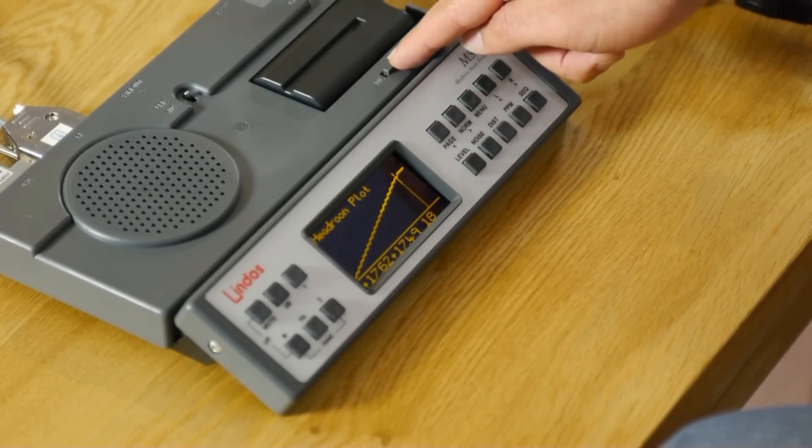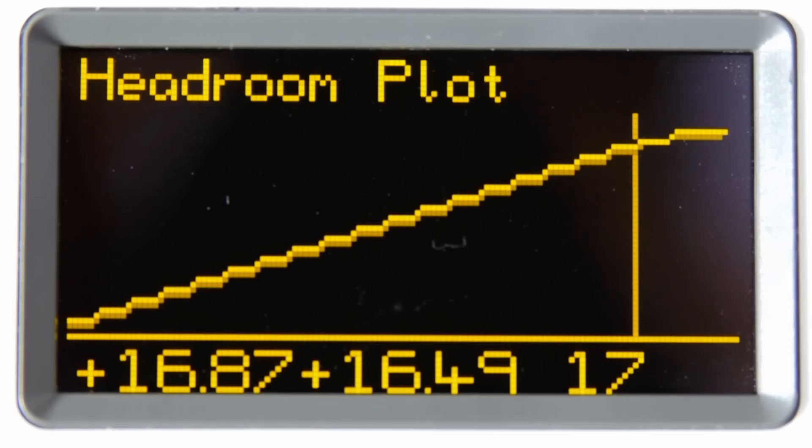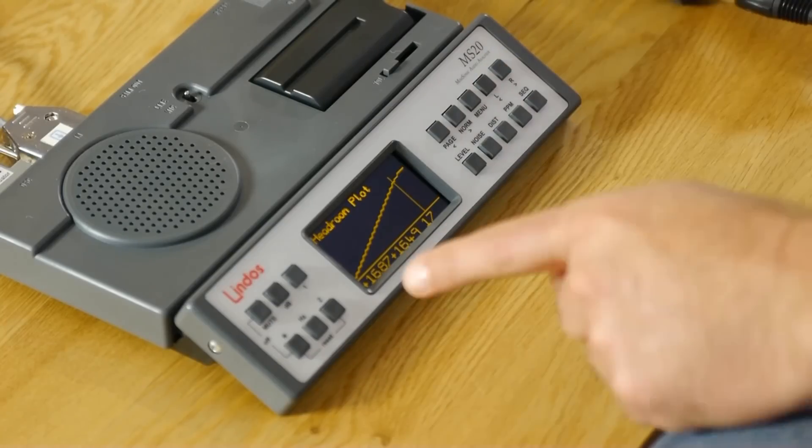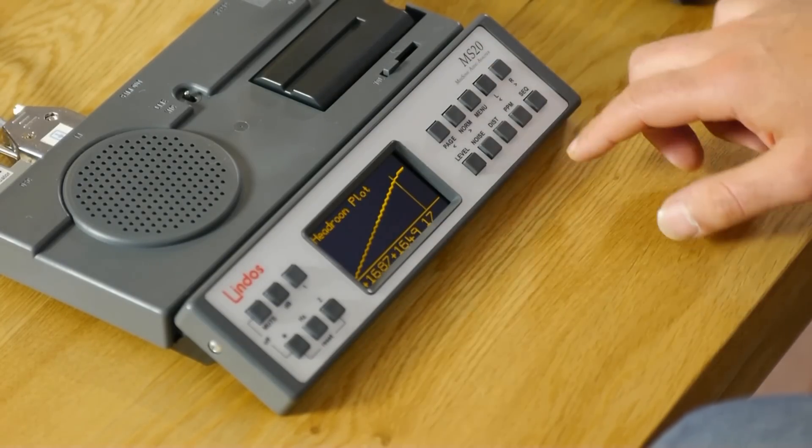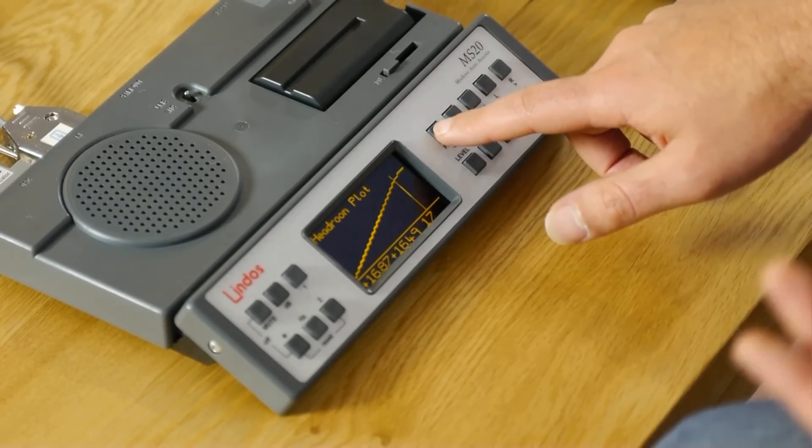Exactly what's causing it is not our problem. Back to the results. This is showing output level versus input level. The test was aligned to run with 18dB of headroom, and then the oscillator went up in 1dB steps and we measured what was being captured. It should go up in steps and it does, so that is tracking correctly, which shows that we're aligned properly.